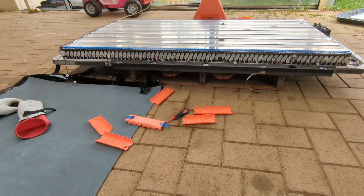And now we're all done. I've now split the pack into nine lots of 14S, and now I've just got to start putting bus bars and BMS sensor wires everywhere to turn it into a battery pack for my home storage.